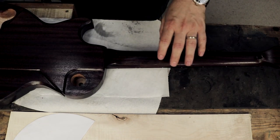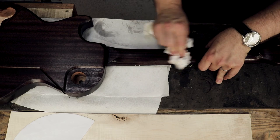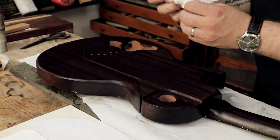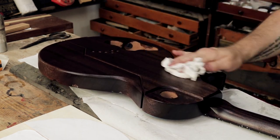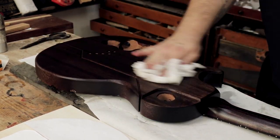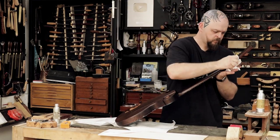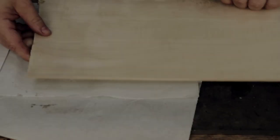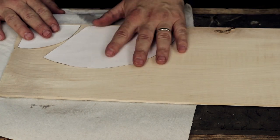I set up the camera to start marking out the back plates onto the wood. And in the time it took me to do that the oil has cured enough that I really need to rub it back. So here we go — all the excess oil comes off. This isn't a film finish; you don't rub it back with wet and dry paper after the fact. You get rid of it as each application is going on, and that builds up a perfect finish.